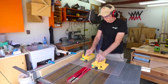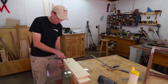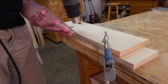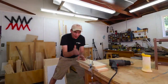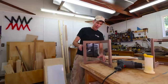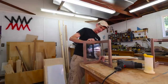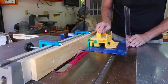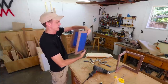I'll cut this piece of plexiglass down to size using my table saw. I'm going to try to bend this acrylic using my heat gun. I'm not sure if I got it at a sharp enough angle — it's hot. I cut it longer because I wasn't sure if I'd be able to get the bend right in the middle, and I'm glad I did that because I'm going to have to shave a little bit off of each side to get it centered. Putting some tape on here to prevent it from scratching. Amazingly, I think that's going to work.